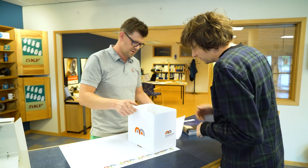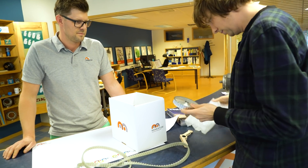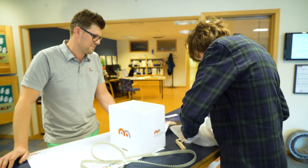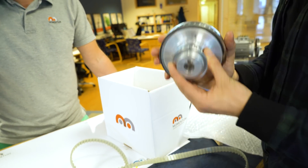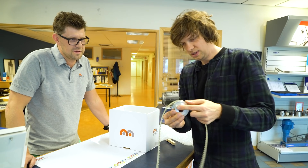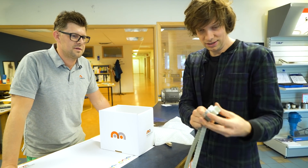So these are the gears we ordered. Oh wow. This is a timing belt — it's like a belt with gear teeth. This is the diameter for our shaft and that's the key way. This little one is going to be on the crank axis and this one is on the sun gear axis up there. Custom made parts — I'm very happy. On the first machine I made these from wood and they were skipping teeth, the gear would climb up, the belt would jump and marbles were shaking and falling off the machine. This will never do that — it'll stay on and I think it'll be really silent too.